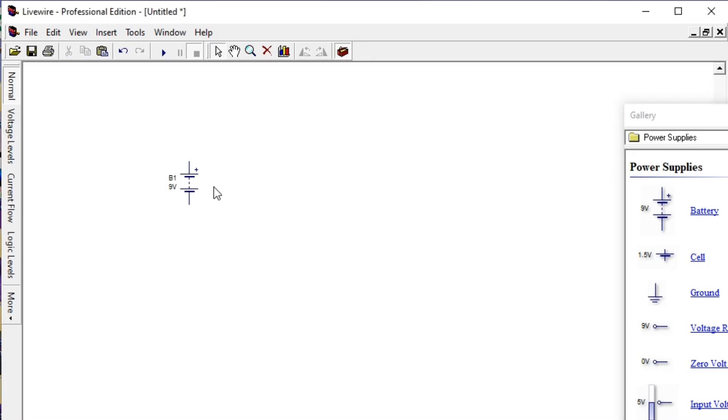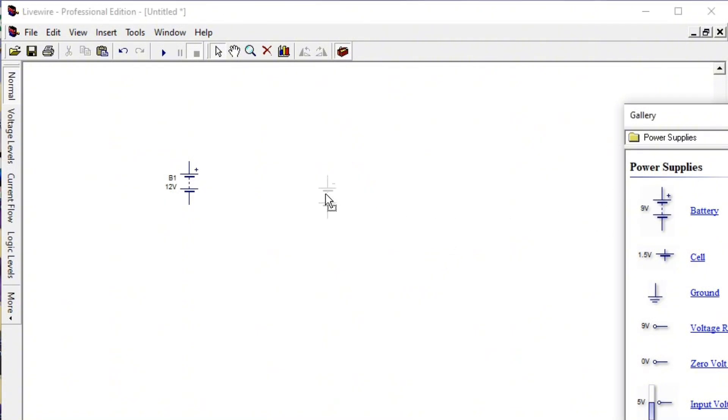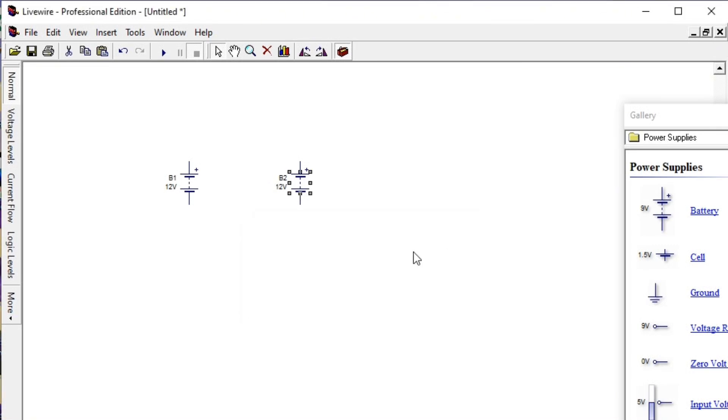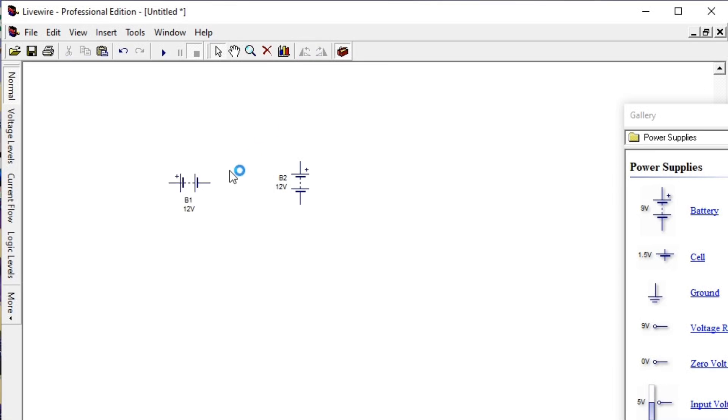So how are we going to connect them in two pairs? This is battery one and battery two, both 12 volts. For you to get to 24 volts you have to connect these two batteries in series. So you rotate this, you rotate this — because negative must meet positive in a series connection. So you have it this way, then you have the output.